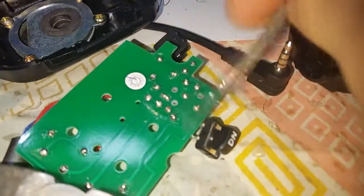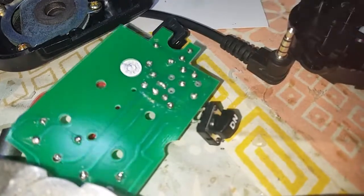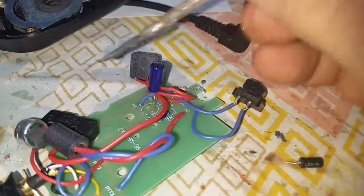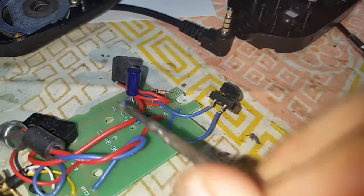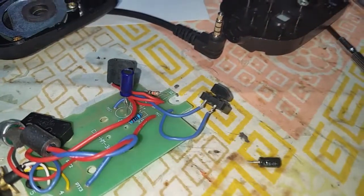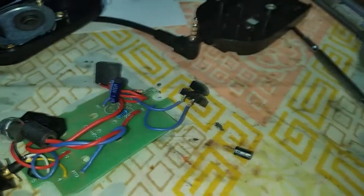All right. And now we're going to desolder the 2 points over here which hold that electrolytic cap in. Now when reinserting the 1 UF cap that I supply you, be sure that you get the polarity correct. The negative is towards this short space right here. So the negative goes that side. That's actually marked on the board here. Actually, what does it say? It says mic negative, but that's a good indicator that the negative of the cap also goes to that side.